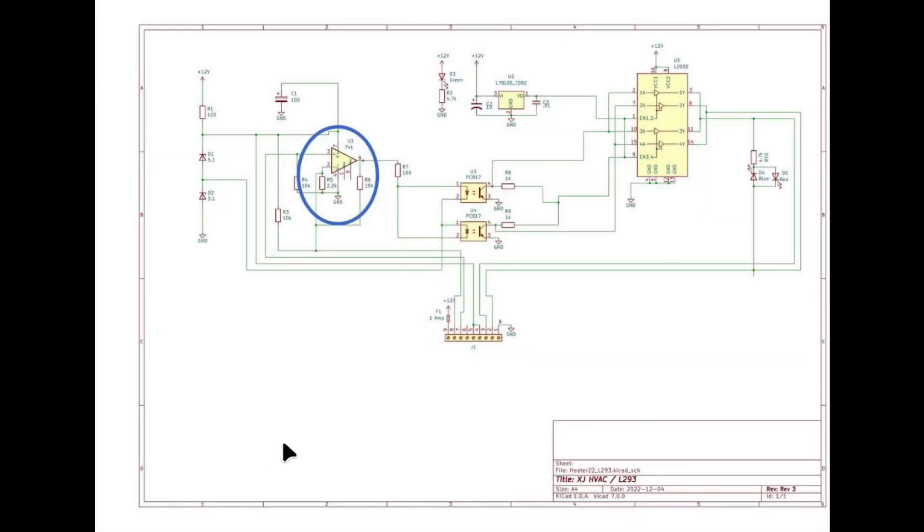To see how it works, let's have a look at the schematic. This is basically the schematic for the standard 293 version. It's the same as I've been using for a long time except for some variation in the output, but otherwise it's the same. It has a couple of power supplies, an input interface in the middle, and an output driver over here, and down here is where you connect your wires. First we'll have a look at the power supplies.